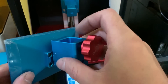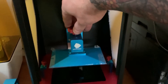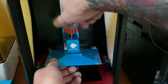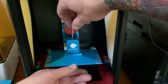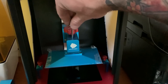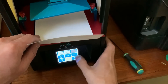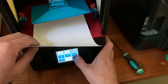Here we have the build plate — this just sits right on top and we can tighten that down. Let's move that up a little so you can see. With the hex key they give you, it can freely move so you can level it. You should leave it loose for now so that once you get it into the zeroed spot you can tighten it up. We're going to lower it all the way to the bottom.